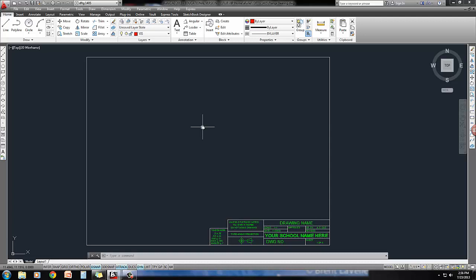So what we're going to do now is actually just start the drawing itself. If you look at the sketch, you can see that it's several concentric circles. I'm going to actually start it with just a line. I'll turn on ortho to make sure it's a perfectly straight line. The distance from the outermost circles and arcs is a distance of 8, so that's where I'm going to start.